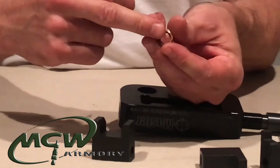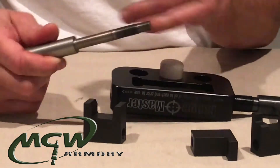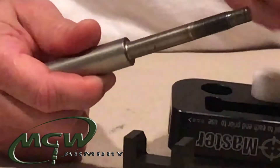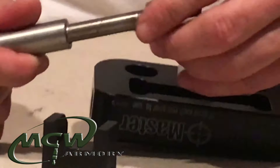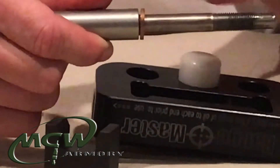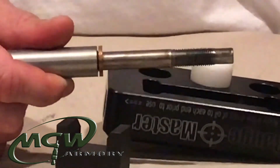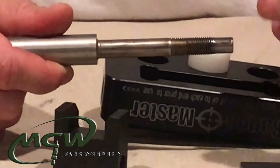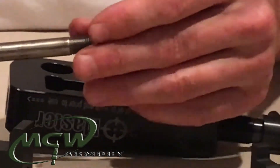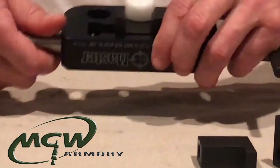When you're pulling it out, be careful when you put it back in — this washer has a chamfer on one side only, and only one of these two washers has this chamfer. There's a fillet radius on the shoulder of the stainless shaft to give it strength so it doesn't snap. If you put this washer in backwards, you'll see that there's a gap and it cannot go down to the shoulder. When you tighten everything up, it presses against that and locks everything up — you can't turn the main shaft at all.